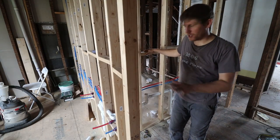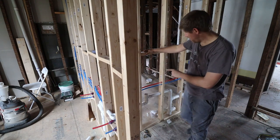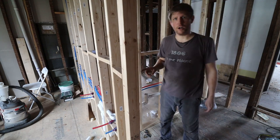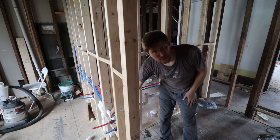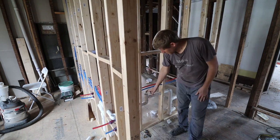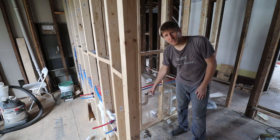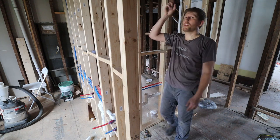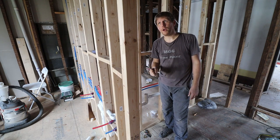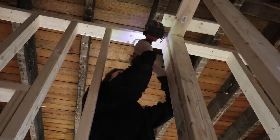We have the basic configuration done of the two vanities over there, the laundry vanity, and also the washing machine. We need to now work on getting the vents completed, and I need to take this vent that is for the two vanities, take it up into the ceiling, and this one that connects the laundry sink and the washing machine, and also take this up in the ceiling. That's where they're gonna connect up there, and then they're gonna go over to the shower area so that they can go and vent together with the shower into the roof.